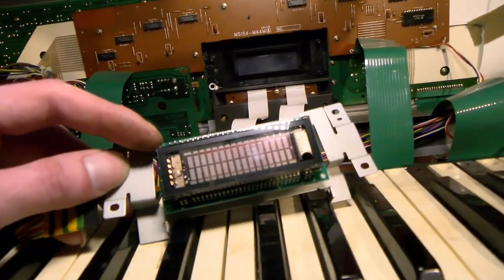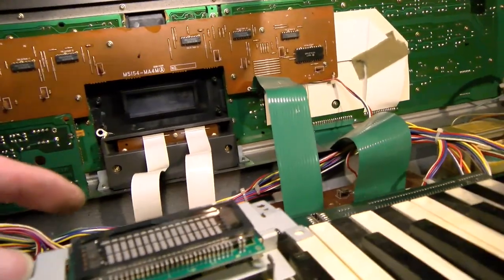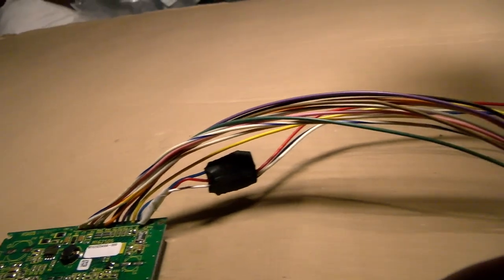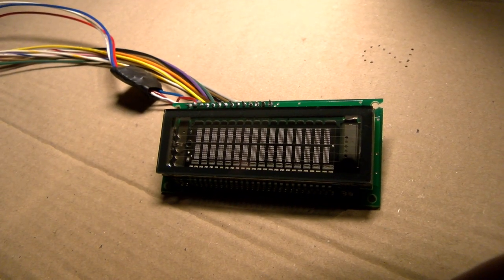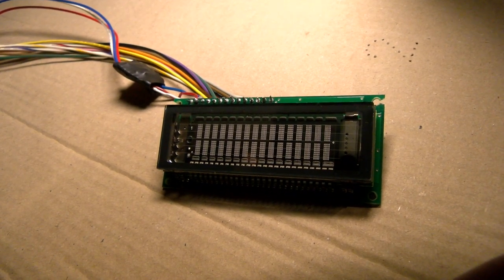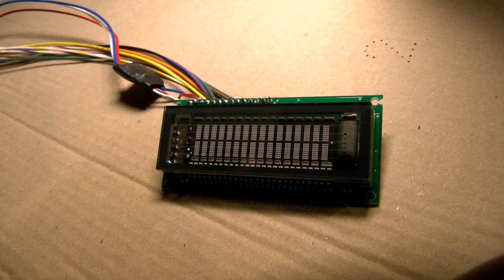Me personally, I think I could fix it. Our display is a Futaba M16-2 SD54AA. You might notice the lack of clone Hitachi IC, and really no ICs at all on there, so to speak of, anyway, nothing that really stands out. This is because all the logic is actually contained within the glass itself. It's chip-on-glass technology. That's pretty clever.